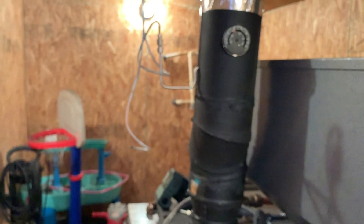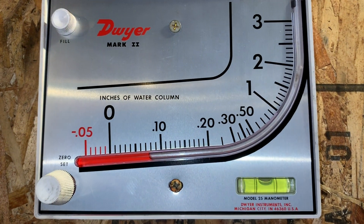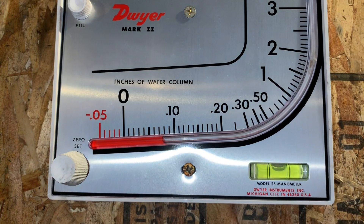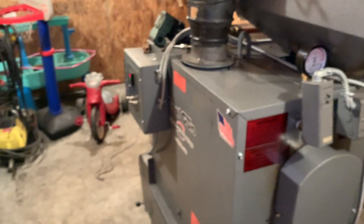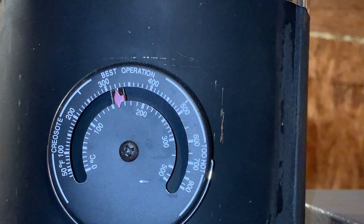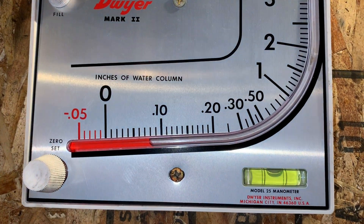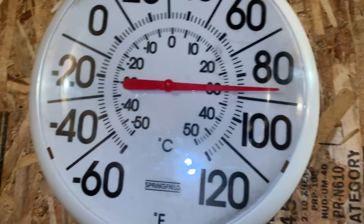It's running right where it needs to run, burning good. These manometers are really sweet — they really tell you where you're at with your flue gas, whether you're plugged up or have good flow. I know when my chimney cap gets plugged with soot, or if the swirl chamber starts getting dirty, you can sure tell the difference. That's what's nice about a manometer — you can see how the draft is. Right now we're at 320 degrees stack temperature and 0.08 draft pressure, with it almost 90 degrees in this room and 18 degrees outside at about nine o'clock at night.